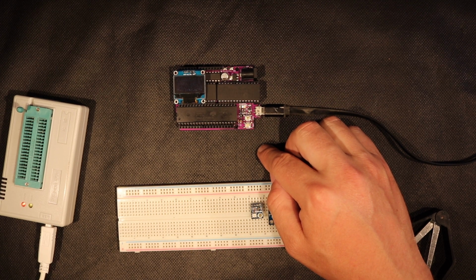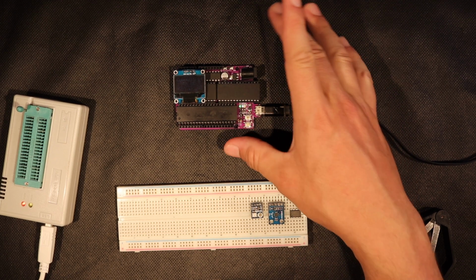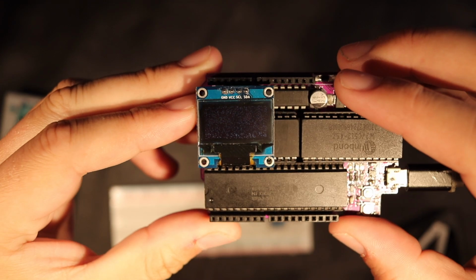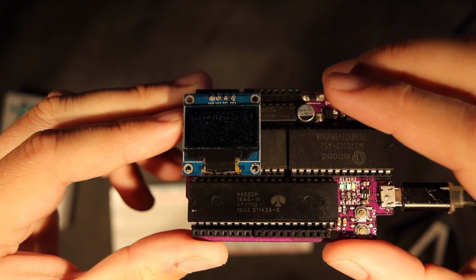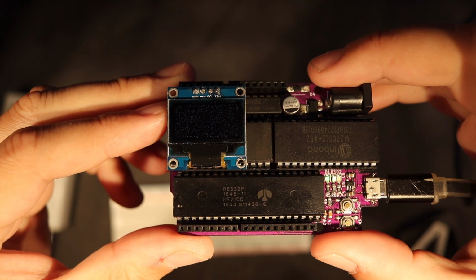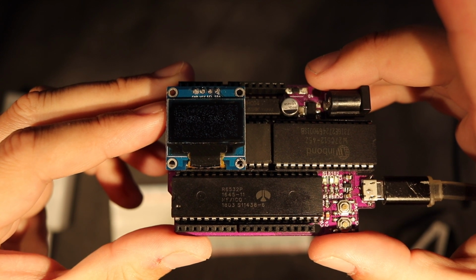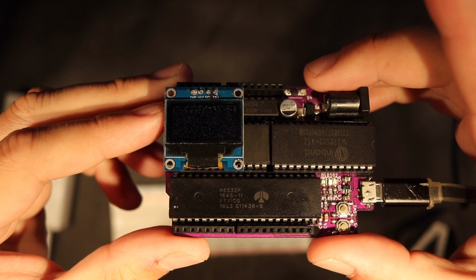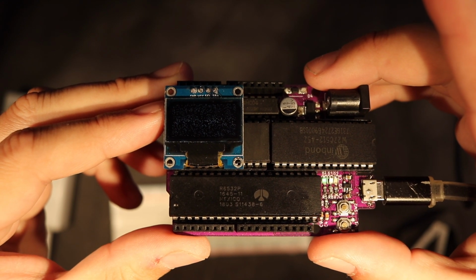And voila! A screen full of random dots. If that's not what you expected, I don't blame you. Since the RAM in the display doesn't initialize to any particular value by itself, and we're not writing anything to it yet, the display simply shows the random data in the frame buffer RAM. If we disconnected power long enough and turned it on again, we'd get a different pattern.